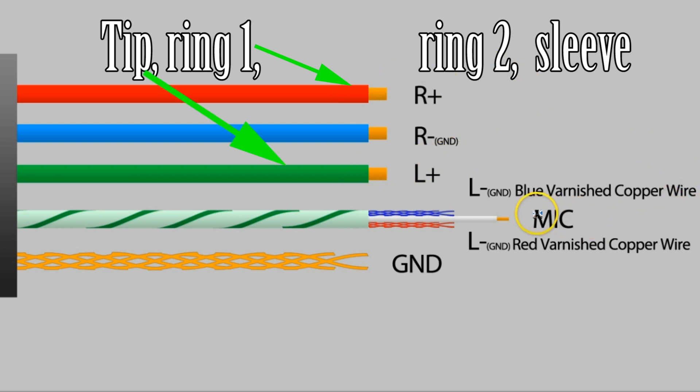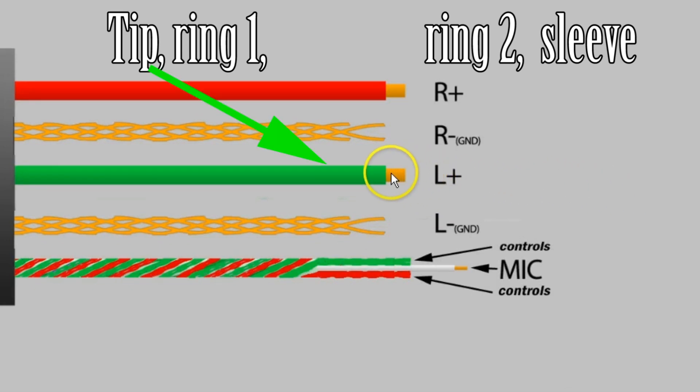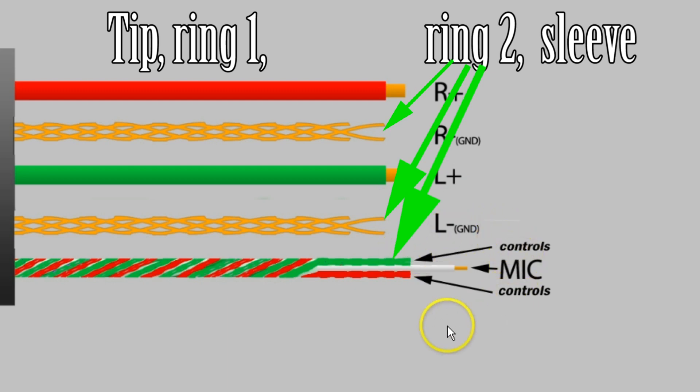This shows that the wires wrapped around the microphone wire are part of four wires that all connect to ground. By the way, if your phone starts with an 'i', at this point in time, these wire colors are likely yours. You must always check the wire colors yourself, because you might see this video years from now and things are always changing.